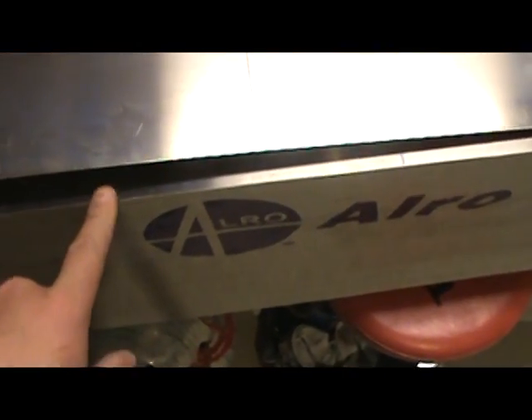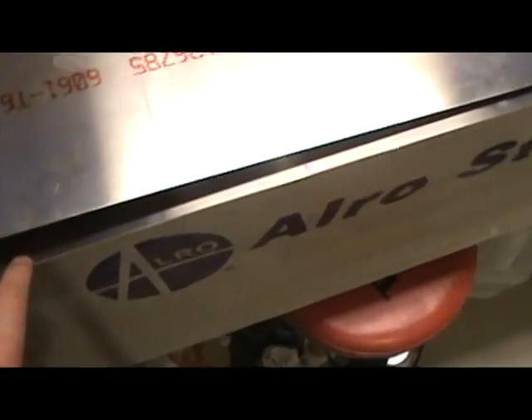The burr on this edge is not a problem. I'm very happy with that — I was very nervous about doing this, as it's a lot of material to waste if you make a mistake. So I'll go ahead and file that clean, then file the cut edge on the remaining piece of stock and do the whole operation all over again with the same measurements, just in reverse, because I'm making a right-handed side and a left-handed side.